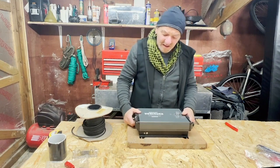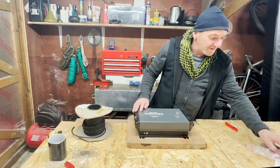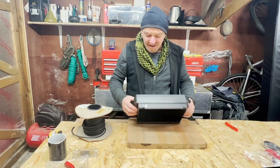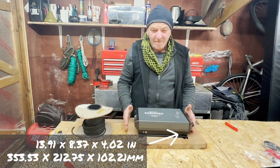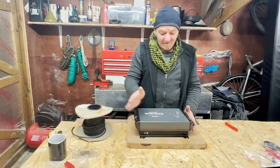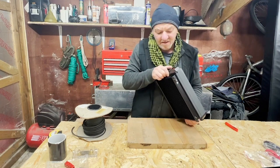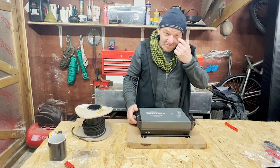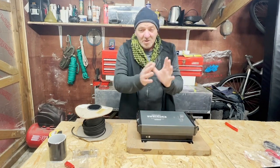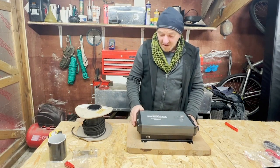The instructions suggest installing it in an upright position using the four screws provided, with six inches of clearance around it — so it needs quite a large space. I've read reports that it can run quite hot, though others say it runs fine full time. Given the size of the vanes, they're probably expecting it to run warm, so put it in a large space and don't squeeze it into a small cabinet or it will overheat and shut down.